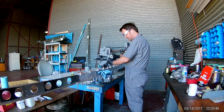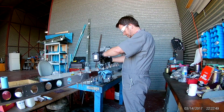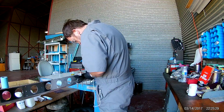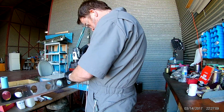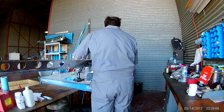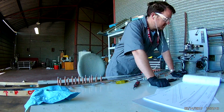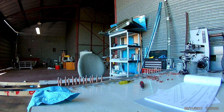So as I am drilling down, I am also Clicoing behind myself. Now the thing is the stringers come completely undrilled. It is just a piece of angle aluminum, or bent angle aluminum, that you slightly shave some of the edges off so it is tapered, and then you have to drill all these holes.